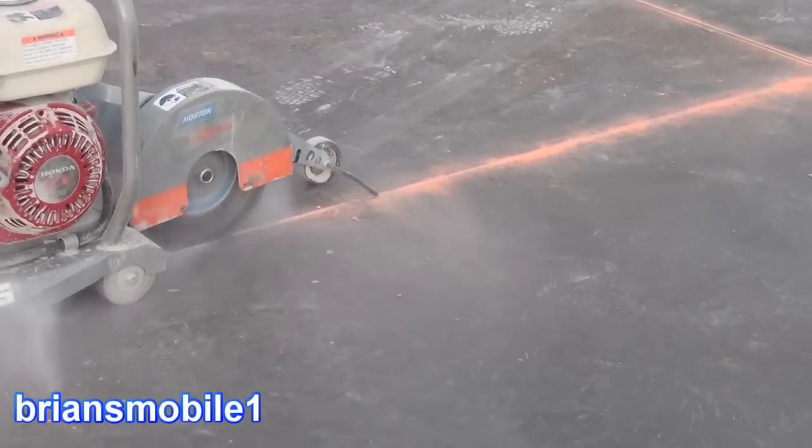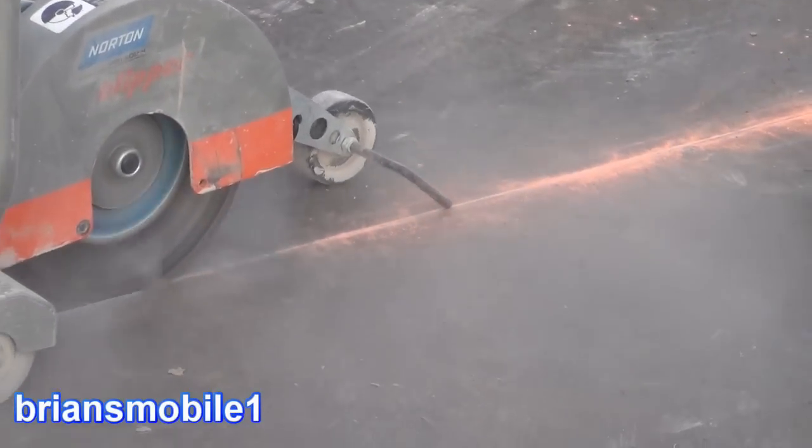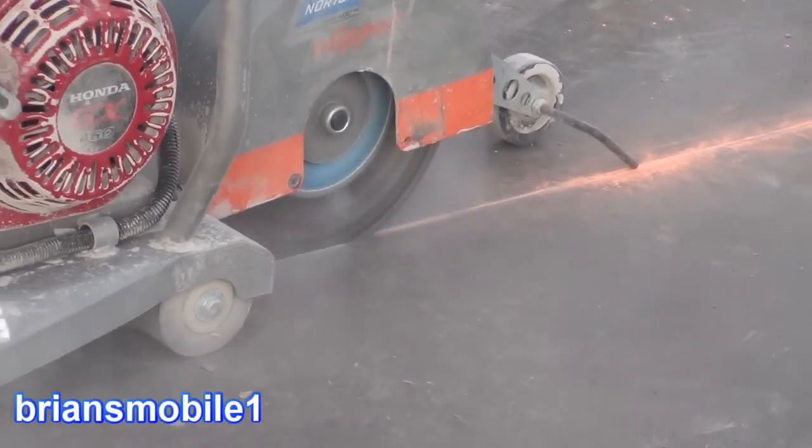We used a concrete cutting saw. It makes a great control joint without being too big, but it can chip on the ends — you've got to be a little bit careful. I had some chipping happen but I was able to get it to crack where I wanted it to crack, so that it looks neat and orderly. Then you can go back and seal those so that water doesn't get in, freeze, and break more.